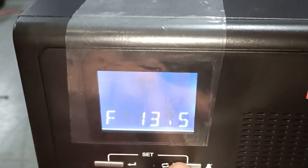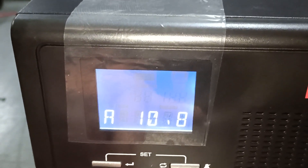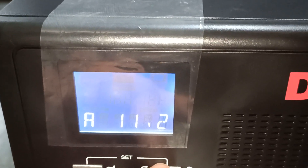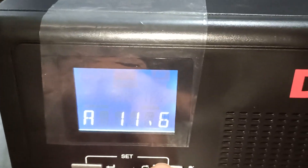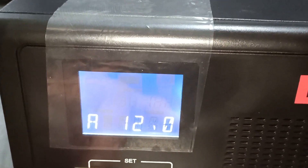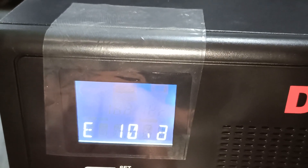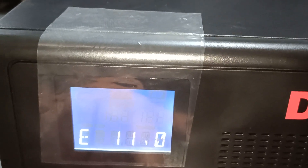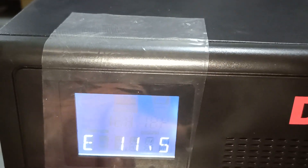Go to float voltage — as the spec sheet indicated, set it to 13.6 volt per battery. Then your alarm voltage: you always want to alarm at 50% state of charge, which is always 12 volt. Your disconnect voltage — where you want to switch off — set it to 11.5 volt so that you don't over-discharge the battery and can get a long life out of it.